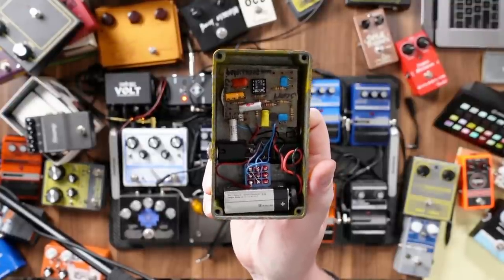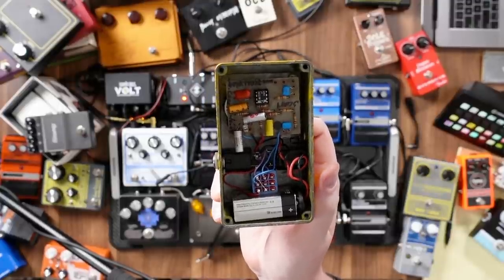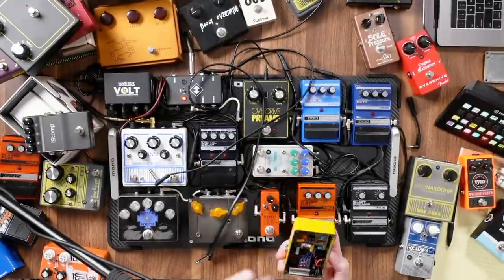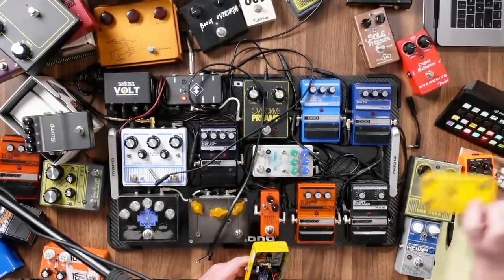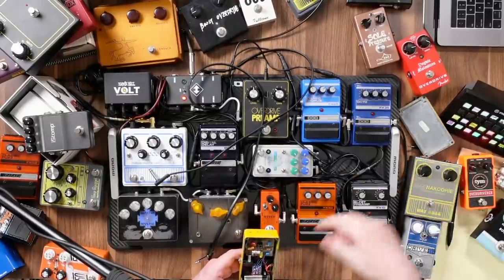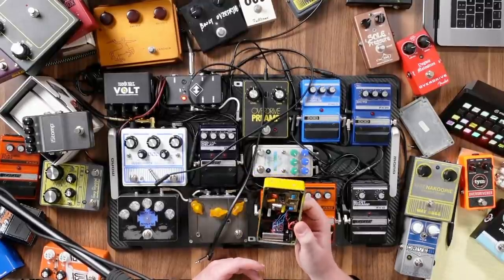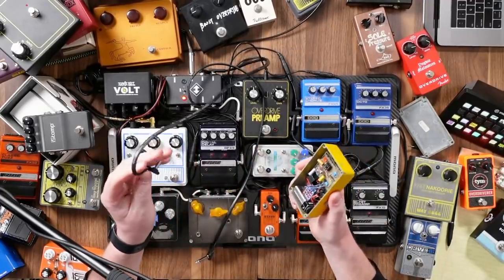So what's happening here is they're probably leaky and unusable, so they clip a leg off and use them as clipping diodes. And then the op amps are changed, all the caps are changed. And then I see the name that gives it away on the back plate. It says proanalog.com. It's Scotty Smith, one of the boutique fathers, sort of. He basically just mutilated this thing, and I have yet to hear it. So this is a debut of what in the world?